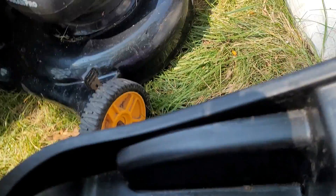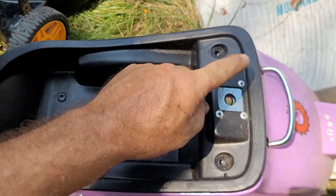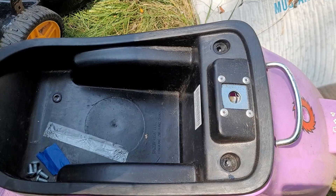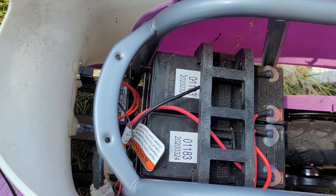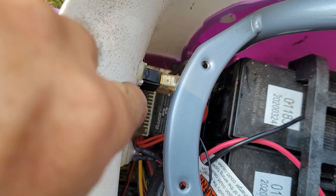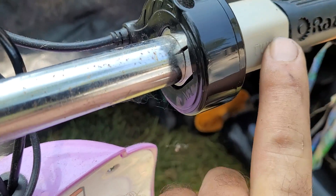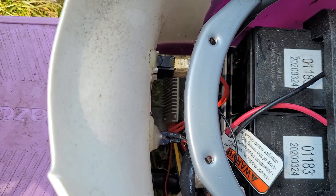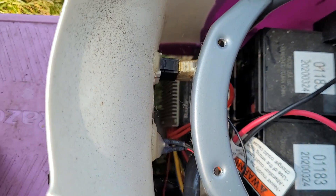To open the seat you just pull the seat. I've already pulled one, two, three, four bolts. The seat pin comes out - here's all the goods. What seems to be clicking is that thing with the silver heat sink down there. That's the speed controller. It's receiving the power from the little twist throttle, receiving the signal to go - I do hear a little click like a relay or something.